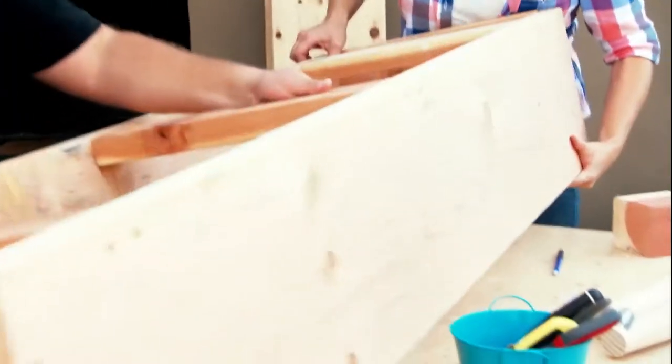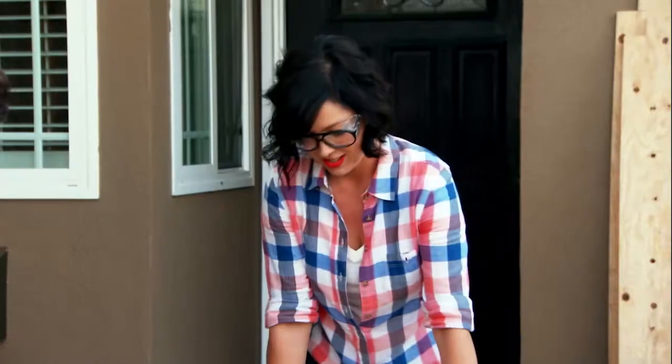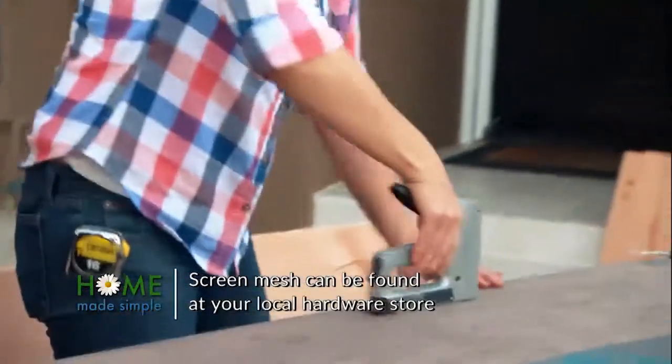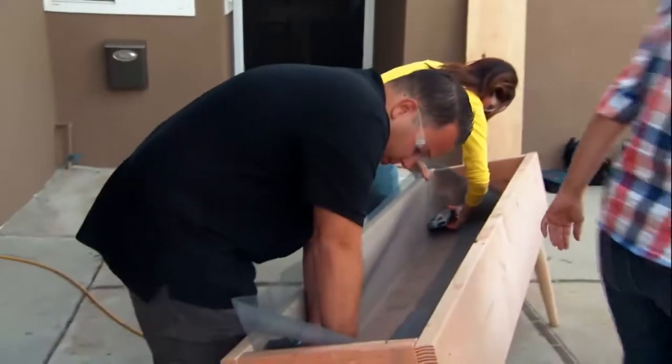Smart thinking. We're gonna flip this on its top and then screw them in from the outside. We gotta put this plywood in that you drilled all the drainage holes in, and then we gotta skin it with that screening so that the dirt doesn't fall through the drainage holes. And then drop it back in. You're gonna want to staple it to the sides and then trim off what's extra.